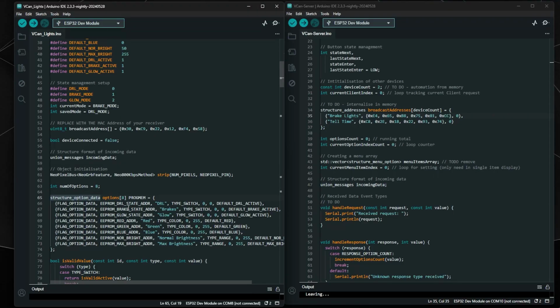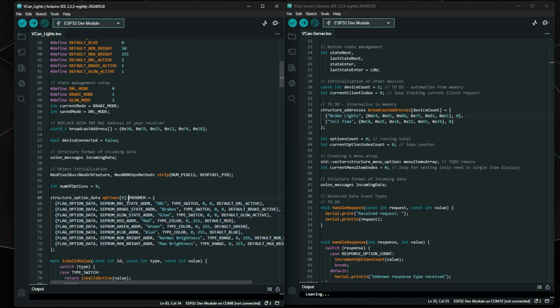Oh, and it's also worth noting that this uses PROGMEM. So this actually stores all of this in flash memory. Considering I'm using 186 NeoPixel bulbs, which can require 3 bytes per bulb, it's really easy to get to the end of the maximum memory size for ESP32. So all of this stuff I'm doing in flash memory. The read-write is completely fine, it's fast enough, it's not like a speed concern. So yeah, that stuff is written in and out of flash memory, which is what this PROGMEM is.